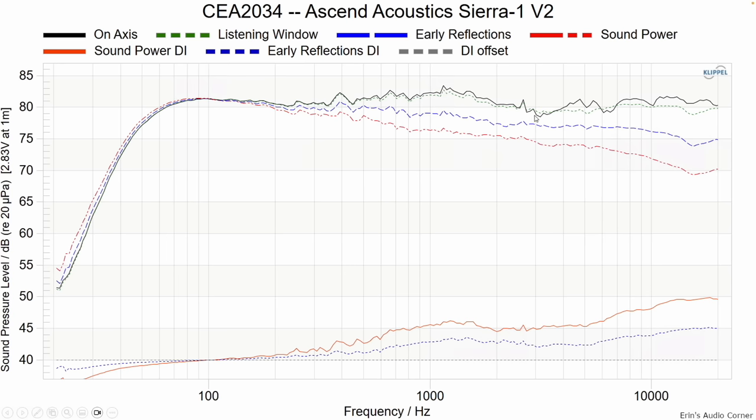Horizontal radiation is about plus or minus 70 degrees throughout 6 kHz, and then above maybe 7 kHz or so, that's when the tweeter starts to narrow. A 1-inch dome tweeter is going to start beaming at around about half a wavelength. The speed of sound is 13,500 inches per second — half that is around 6.7 kHz, and that's pretty much what we see here, so there's no real surprise. If you want to talk about beaming, beaming is really quarter wavelength, but when it's on a baffle we just say half a wavelength because that's close enough.